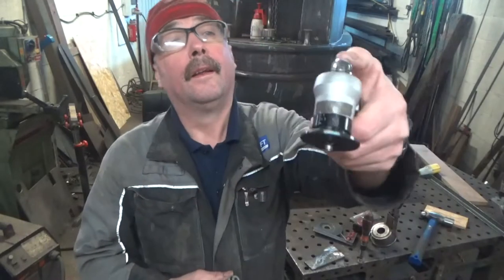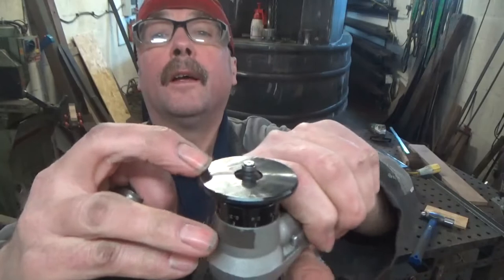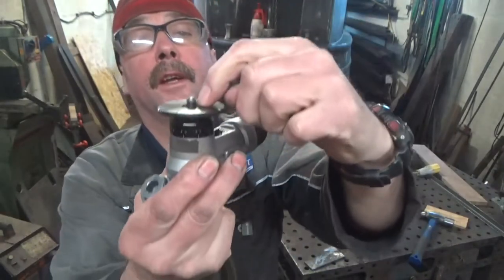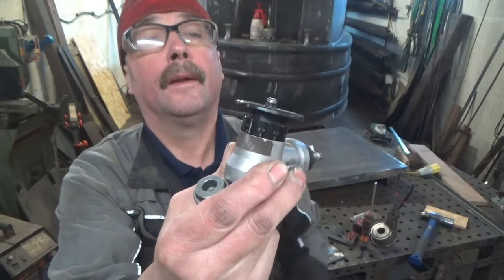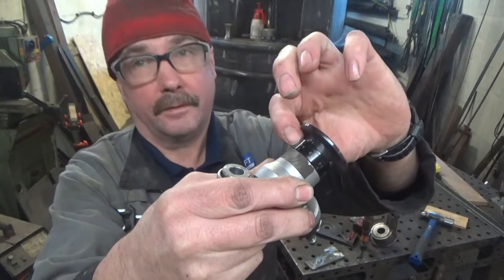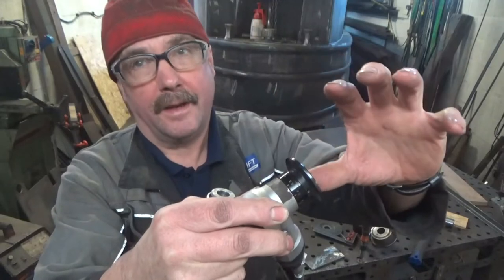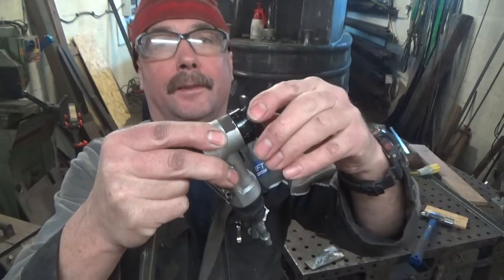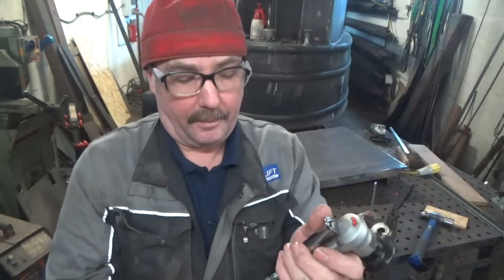There's an airline trigger on top, and there's the cutter - you can just see the cutting edges sticking out. It's got a scale on it: you can undo an allen screw and wind that out. That's at its maximum depth now, which is a fair amount to cut off a bit of steel, so you can turn that in and lessen it if you want less of a chamfer.